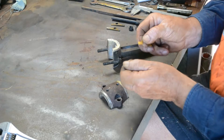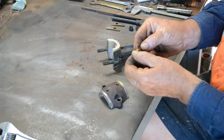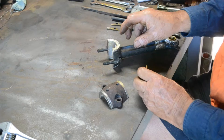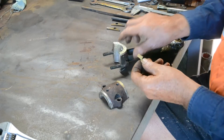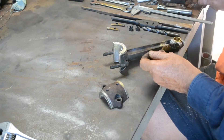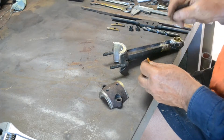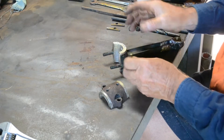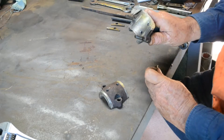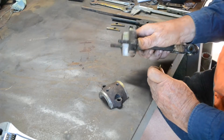They're 30 thousandths of an inch and you have one-and-a-half thousand shims. If you use your fingernails you can peel one off. So when you come to adjust your bearings later on, if your bearing wears, you can pull off one of those shims — you can just use one of these razor blades, very carefully part one off — put it back on, tighten it up, and your bearing will be okay again. I've seen these bearings last the life of the crankshaft.